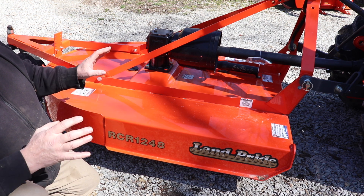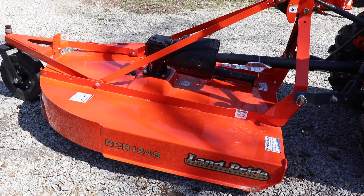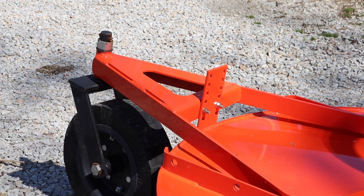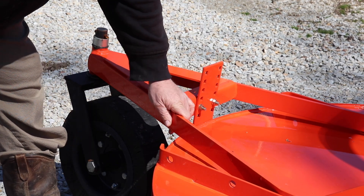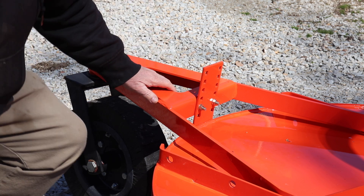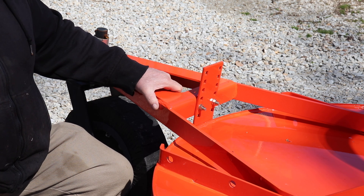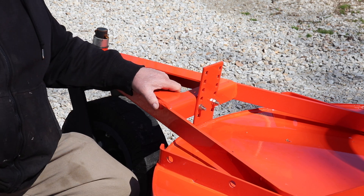There's a lot we're going to have to go over and adjust on this thing. It has an adjustment on the back here — this takes the back end of the brush hog up and down. When these guys put these together, they don't set it for what you want; you have to adjust it yourself. We're not doing real big brush hogging, so we want this down a little bit lower. You could actually get these to almost mow grass — you don't have to just use them for brush hogging. You can cut a field that you want to maintain regularly.